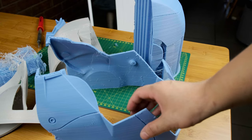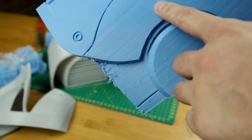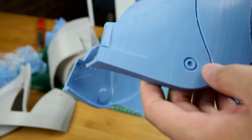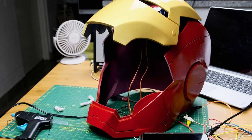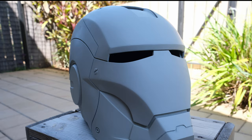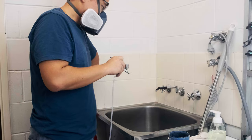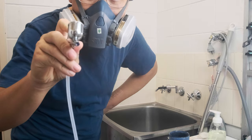I don't have too much to say about the printing — you can tell how terrible my printing is. If you have bad printing like I do, you'll probably need to spend longer fixing it. Do you want your helmet to look perfect? Then it's time to see how patient you are. You need to sand it and apply filler to smooth the surface. This process will be repeated many times. Once the helmet is smooth enough, you can spray it in your favorite color.